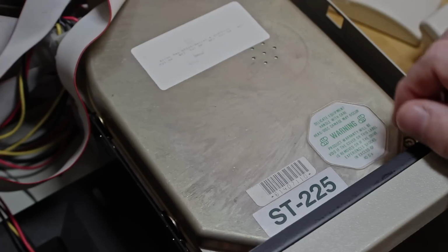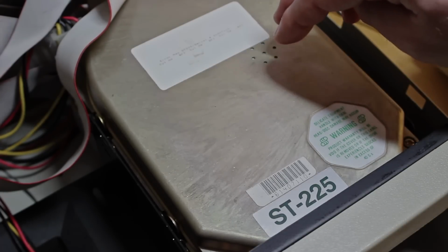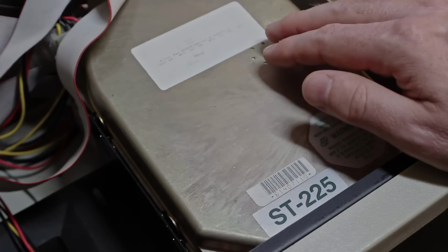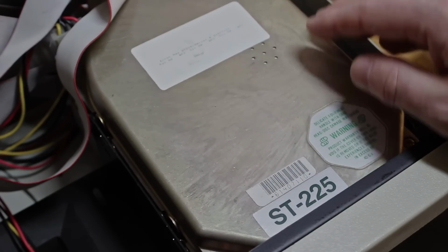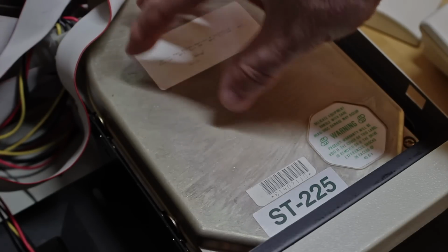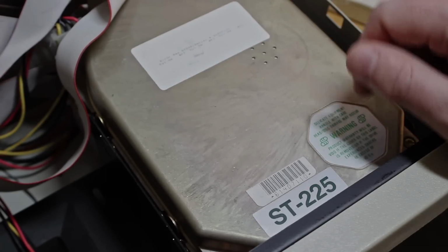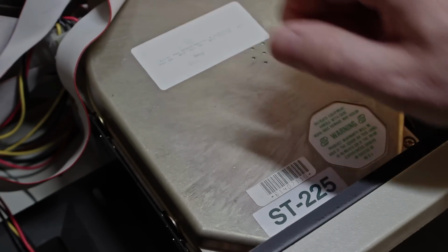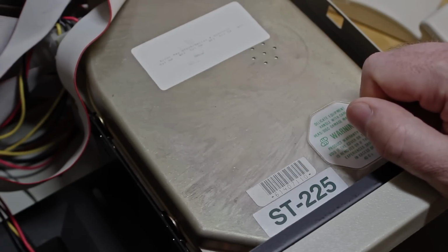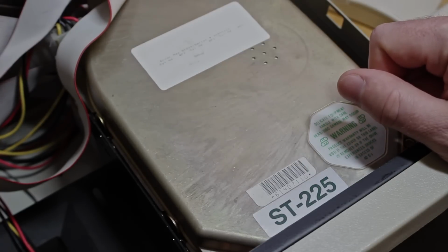Now, I'd actually done this off camera after viewers made that comment, and not long after that I started to notice issues with the drive access. But since then, viewers have reassured me that this can't possibly be due to the interleave. Well, the other thing I noticed is that the problem was more severe as the drive heated up. The drive can change shape slightly as it heats up, and maybe things are just no longer under the head. Perhaps I formatted the drive when it was stone cold and should have waited until it had warmed up before I did that. So that's actually what I'm going to start with today. I'm going to low-level format this thing after letting it heat up for 45 minutes, and then we'll see if we can get reliable access.